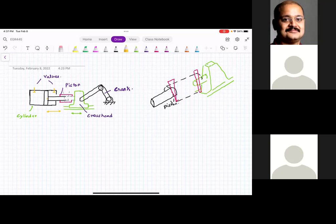Both designs are possible. If you have a crosshead integrated with a socket, you can use a single cotter joint - that design is acceptable. If the crosshead just comes with a rod and not a socket, then you would use a double cotter joint. The advantage of a double cotter joint is it allows you to attach two rods with different diameters.